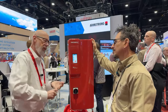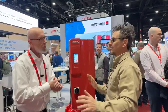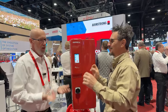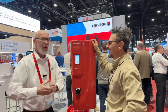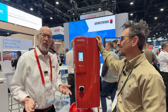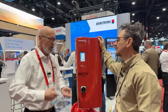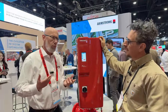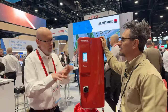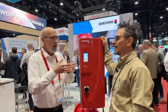This is significantly lighter in weight. For the people who don't understand what a permanent magnet motor is — can you explain it in layman's terms? For years and years, we've used squirrel cage induction motors. That's a standard motor with copper windings, copper on the rotors, a lot of steel. There is no magnet in that motor. As soon as we add electricity, we create two rotating magnetic fields — that's what causes the motor to spin.